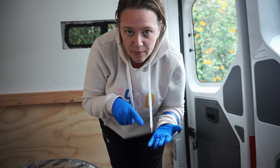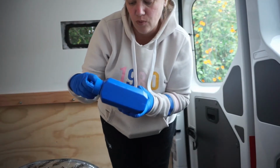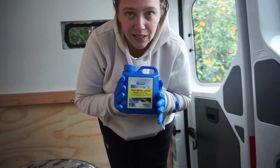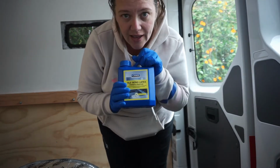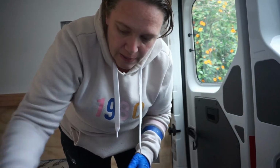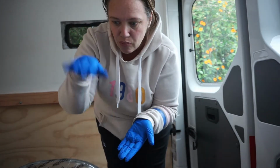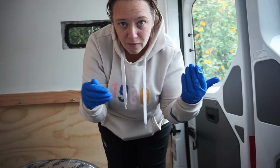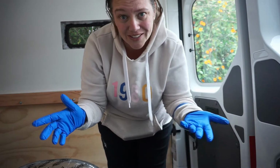So you would have seen that I've just finished waterproofing, and now the next option, it's kind of still connected to the waterproof, is I'm going to slap this tile and bond latex all over essentially the whole shower. This is a little guy that I picked up from Bunnings, and the point of it is, because the wood's porous and I'm going to put the waterproofing painted membrane on it, this is essentially a bond to help the waterproof membrane stick to the wood.